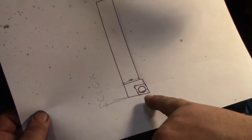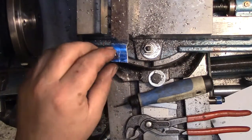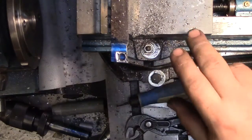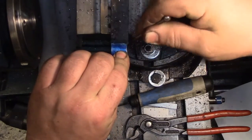Now I've got this pad taken down and I have the front angle and the side angle taken care of. I've got my side relief. I just want to put a quick scribe in to give me an idea of how far I need to go, and I need to make the pockets because the angles are going to be established by the table. Let me grab something conveniently sharp, like a pointed center finder, and just get something in there.